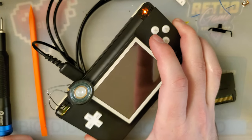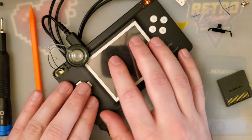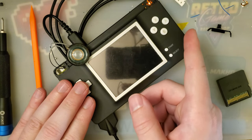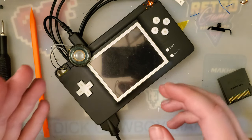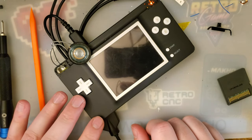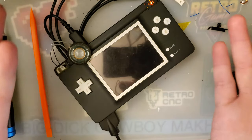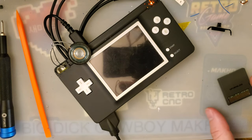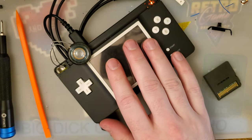If you're worried about keeping your DS mostly stock, well, then don't do a TV out mod because that patch is required. If you ever need to roll your DS back so you can use two screens, it's just a matter of running the FlashMe installer again or restoring the backup, but the FlashMe installer should work either way. It turns out with DS consoles, in pretty much every case, you can go up with firmware, but you can't go back. So it should work as long as you're using at least V8, and that's what the FlashMe is. But anyway, once you got the software set up, even if you wanted to skip that, you can just purchase one of those extra wireless cards, and they come pre-flashed with the TV out patch enabled.